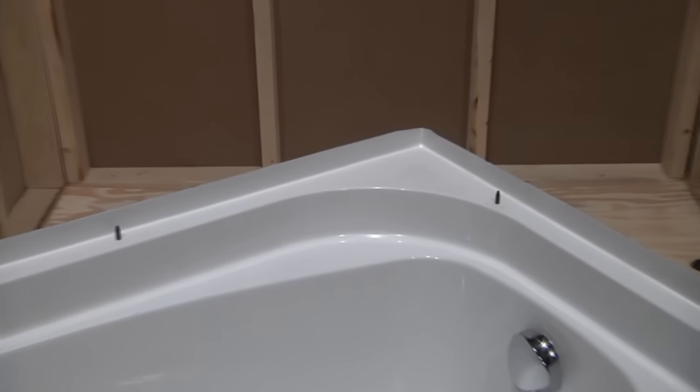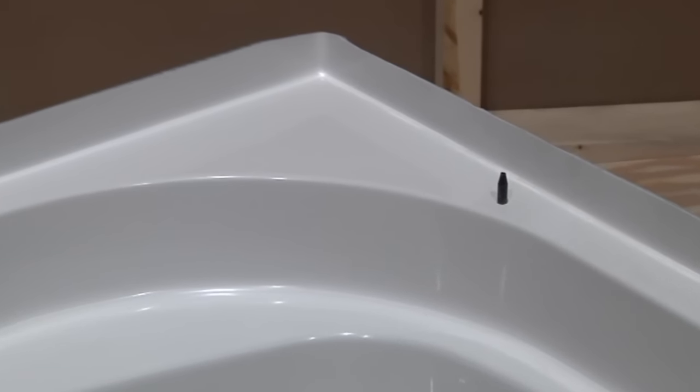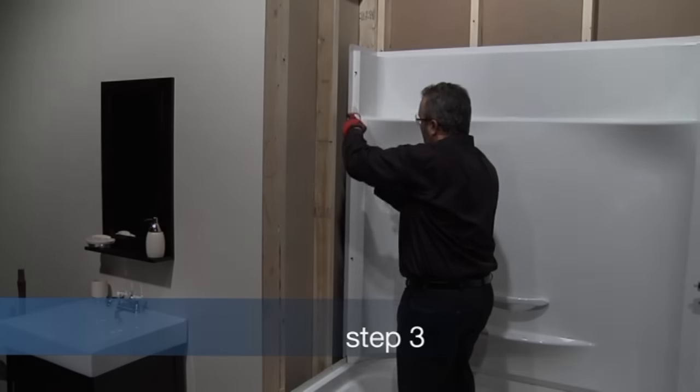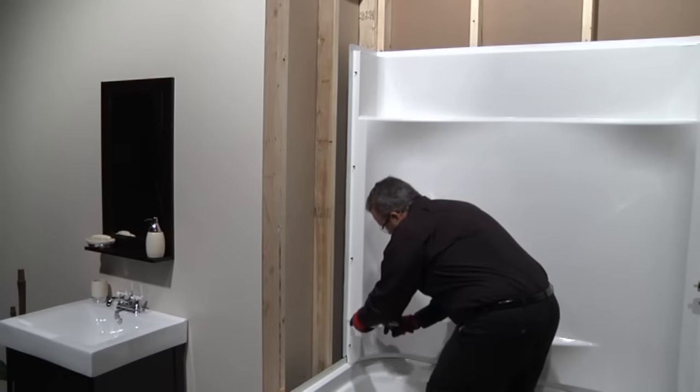Exclusive to MAX: the hassle-free front installation patented pin system provides a tight fit between parts. The pins are made of sturdy material featuring great stiffness, high impact resistance, and stability. They are strategically positioned to provide a fast and easy installation. Step 3: Apply silicone along the sides of the back wall, going around the positioning pins.